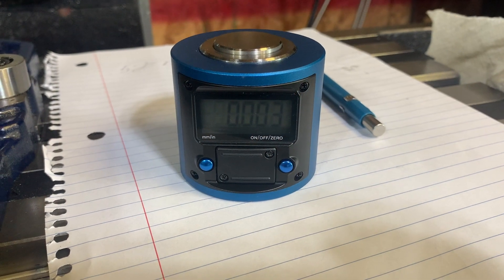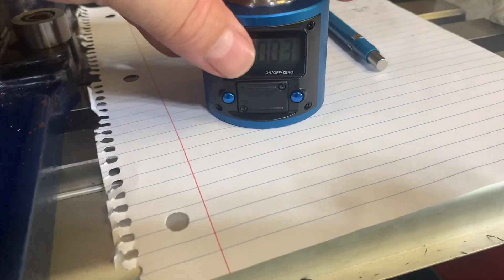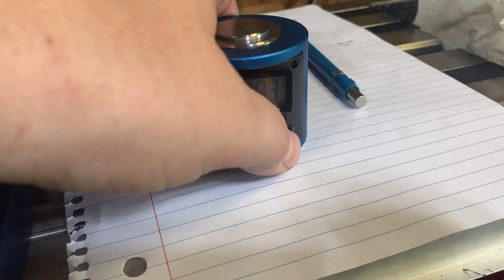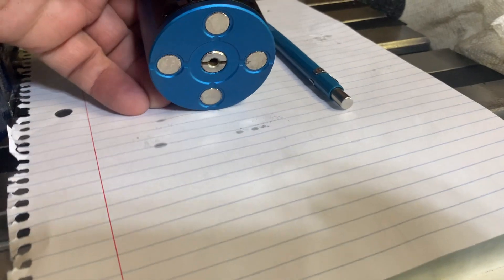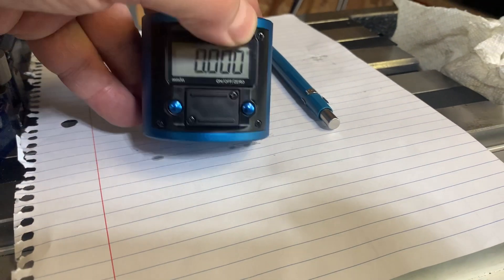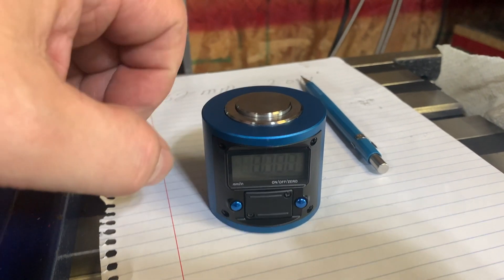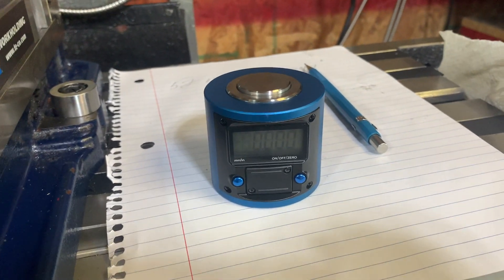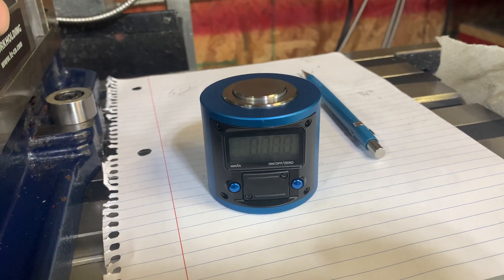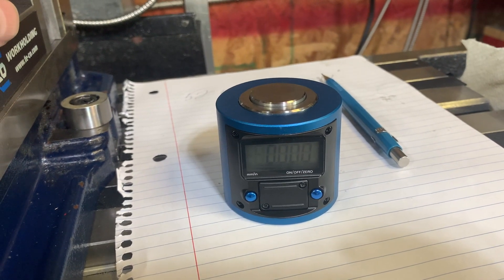Let's have another closer look at this thing. You can see our three thousandths of an inch is still there — we'll zero that and voila. Here's what it looks like underneath again. The magnets are really nice to have, but just be cautious that since we're dealing with metal, having a magnet can actually cause you some issues in your measurements unless things are very, very clean.